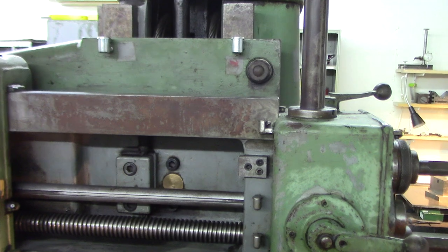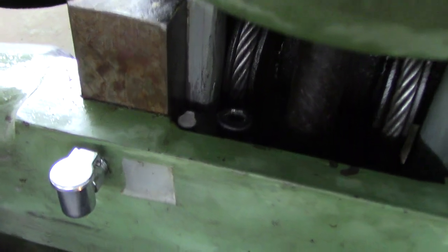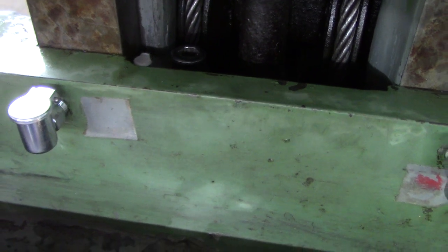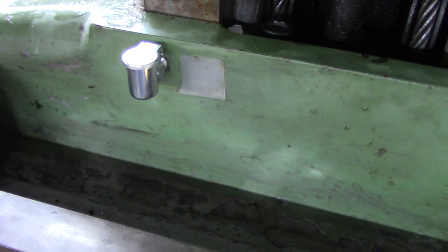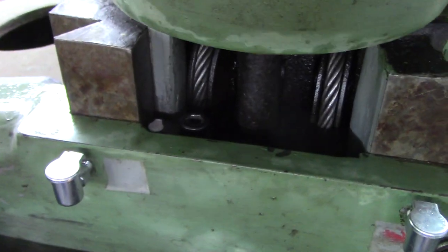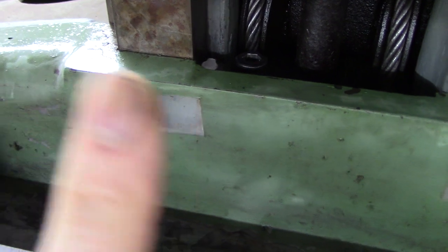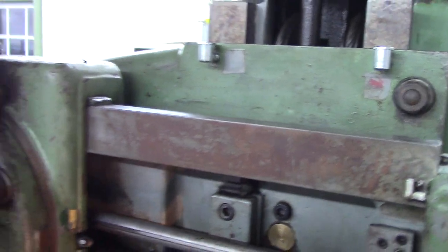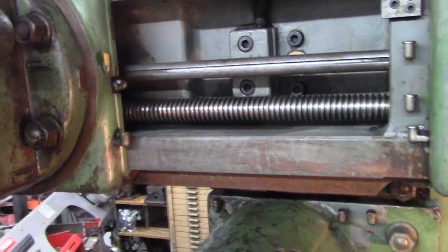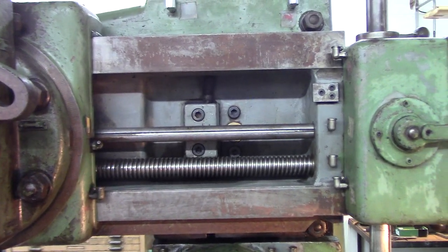The gib is down inside. You can see I painted the oil cup white, and it's got an Allen head screw for an adjuster. These oil cups were grease fittings and I changed them to what you see there. There's the cables for the counterbalances, and there's the tapered gib with the oil cup. So that's cool. Man, this thing was black and dirty. Notice all the flip top oilers for the shafts and whatnot.